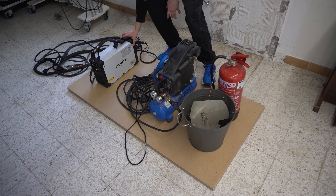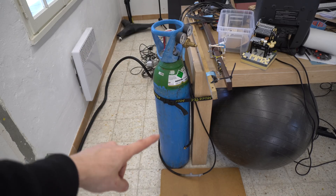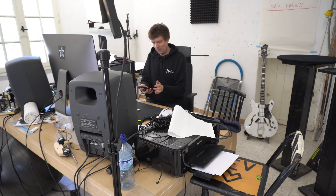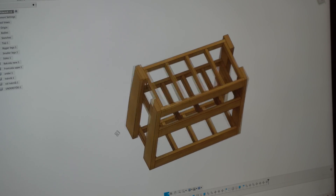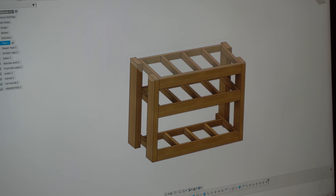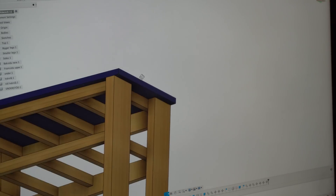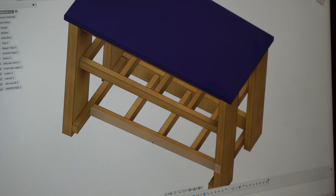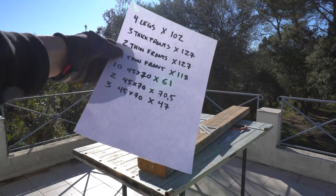I'm just laying out the machines that I want to fit on the bottom shelf. We also need to leave place for the argon tube. We're in the CAD program. I'm very happy that I did it in CAD because it let me think about stuff — for example, that I want to be able to clamp on the side here and here, and also leg room down here. I now know how I can use my scrap material to the best. Let's make a cutting list out of this.